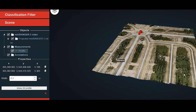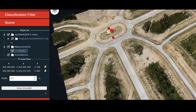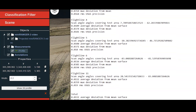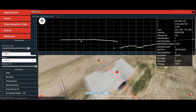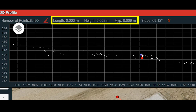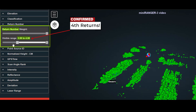Taking a look at a subset of the processed data, the Mini Ranger 3 was able to achieve Kestrel's project objective of high precision and high accuracy as-built. We see the Mini Ranger met and exceeded the USGS Quality Level 0 specifications. The data exceeded the first key specification requirement of less than or equal to three-centimeter intra-swath precision, as the data was consistently under two-centimeter RMS on hard surfaces. The data also exceeded the second key specification of achieving a minimum of three returns — we actually see fourth returns present in this dataset.